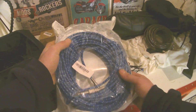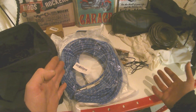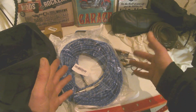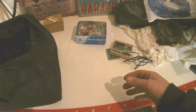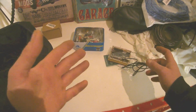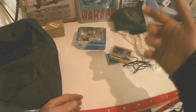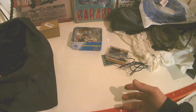Regarding the wiring, I needed a three-core wire and the best solution I found was audio jack cable - it's already shielded, which is a plus, and it was readily available and cheap. This is what's going to run the wiring from the PC and the Arduino to the roller itself. When we put Mike's bike in, every other bike was fine, but as soon as we put Mike's bike on it, the interference must be like background noise - similar to how older cars needed a suppressor to hide background noise from the engine.